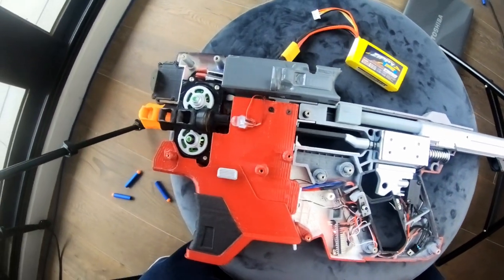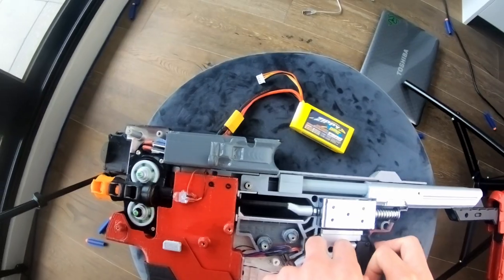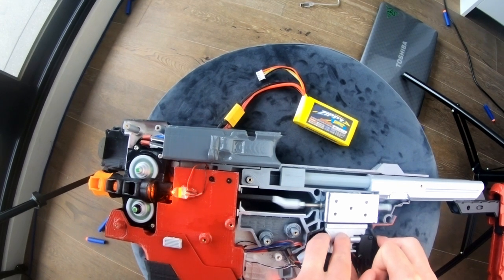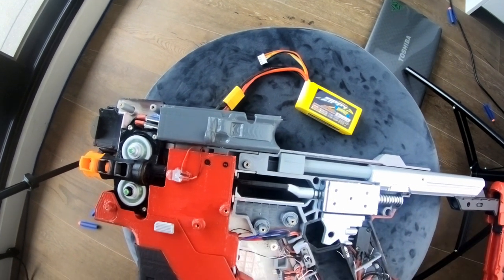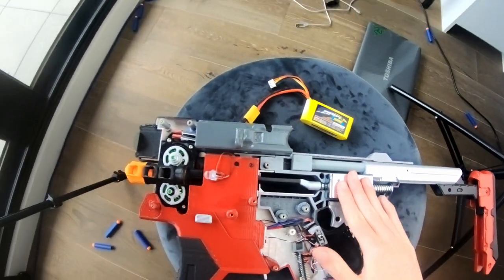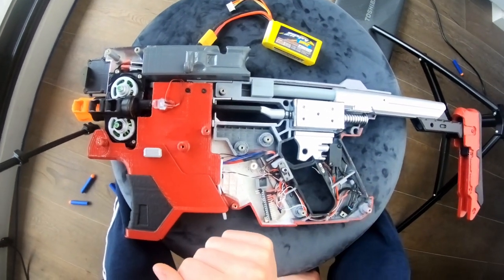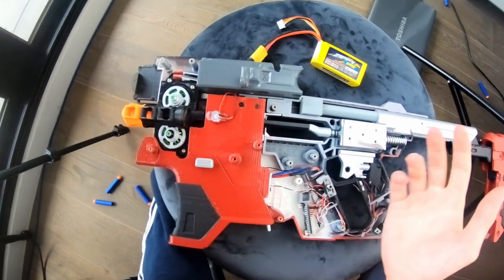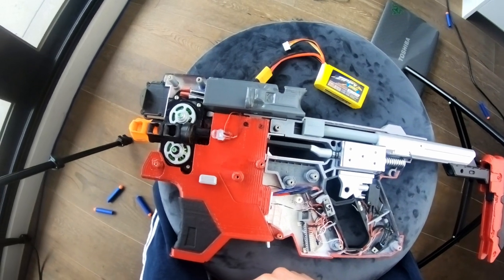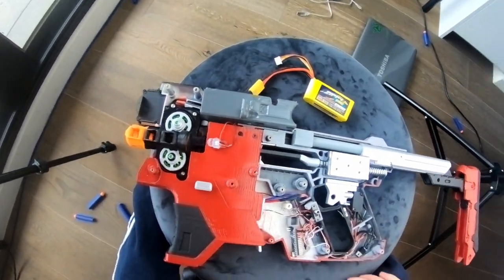Let me demonstrate that now — it takes a few seconds to arm the ESCs. You'll see the LED and the solenoid are in sync. Sometimes it makes that cool little revving sound at the end when you turn it off. If you want to see the Arduino code, that's also in the link below in the build log. Go there, download the code — it's free — modify it, use it. There's an explanation on the build log on how to use the code. You can change the numbers to adjust motor speed and solenoid fire rate.